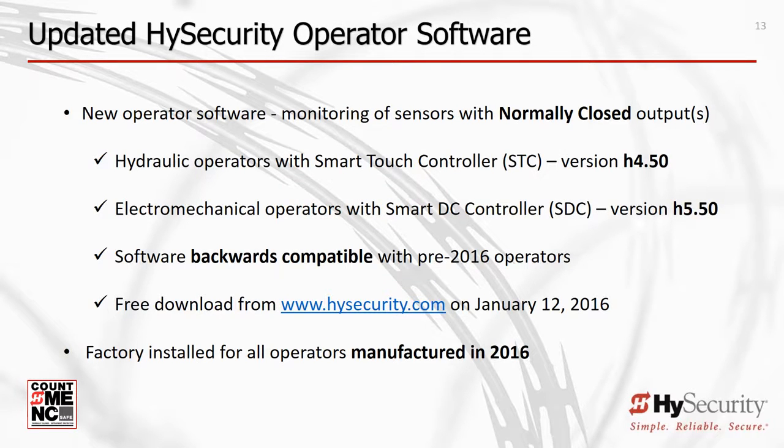There are three methods that gate operator manufacturers chose to meet UL 325 6th edition external sensor monitoring requirements: pulsed 2 or 4 wire, 10K resistive, or normally closed, NC. HySecurity implemented the third method, normally closed connections, with a simple software update which minimized the impact on installers and reduced the risk of a complicated, unsuccessful install.